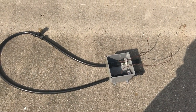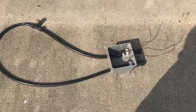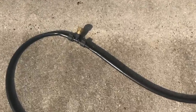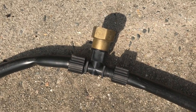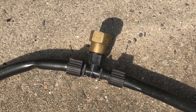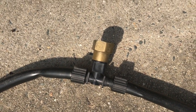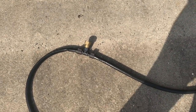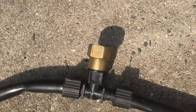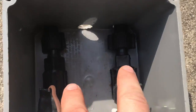We've got two solenoid valves installed into a weatherproof box. We drilled some holes in there and we've got some poly tubing. We used a T-connector — that's where we're going to put our hose input. You're going to want to use backflow prevention if you're using water supply coming from your hose, to prevent water from backflowing into your water supply. This is where our water is going to come in — a hose nozzle into a T-connector that splits into two runs, pressurized up until this point.